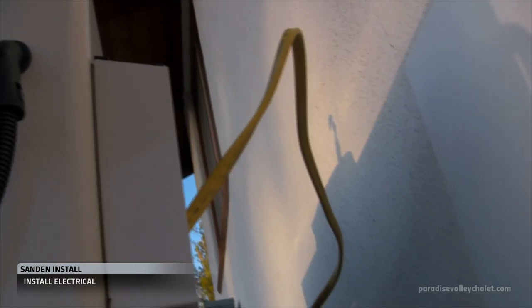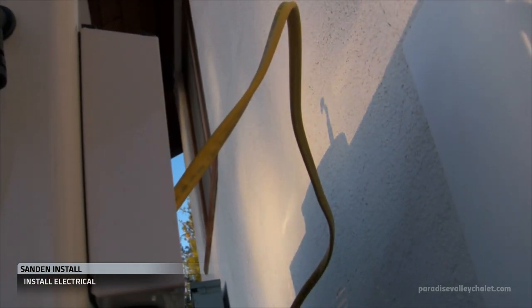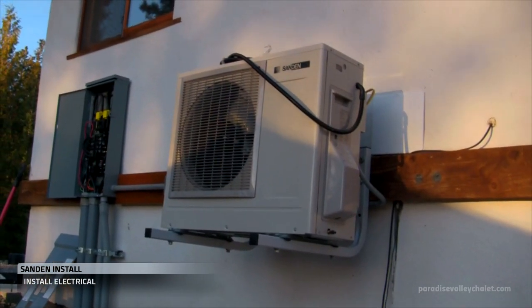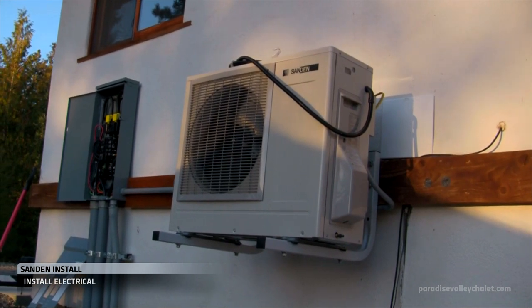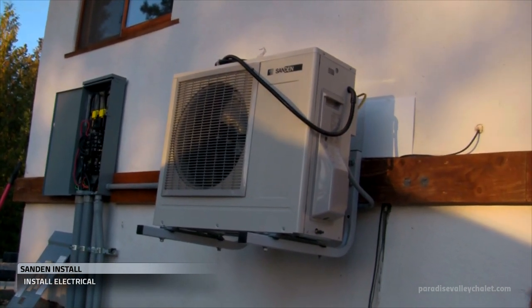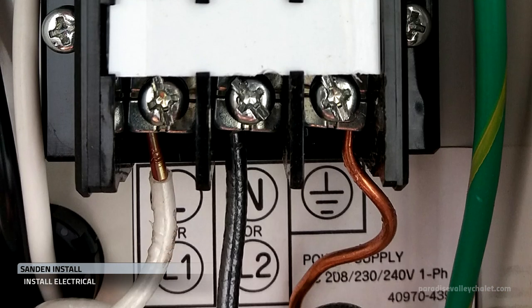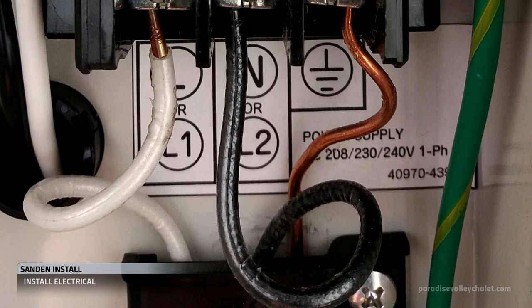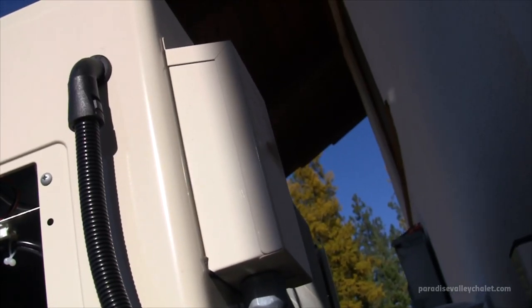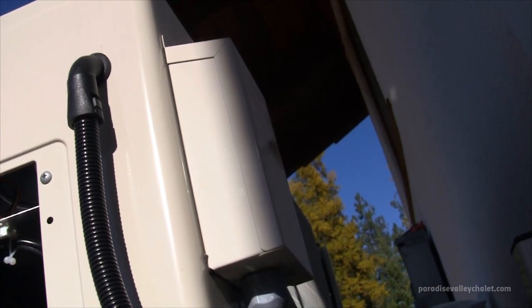All we have to do now is hook up the wiring on the heat pump. Normally you would install an electrical disconnect right next to the heat pump, but since our panel was within eyesight of the heat pump, we chose to go directly from the panel to the heat pump. The two wires on the left are power and the wire on the right is your ground. Coming directly from my two-pole breaker on the panel, I landed white at position one and black at position two. We're all wired in — we'll come back and power it on later.